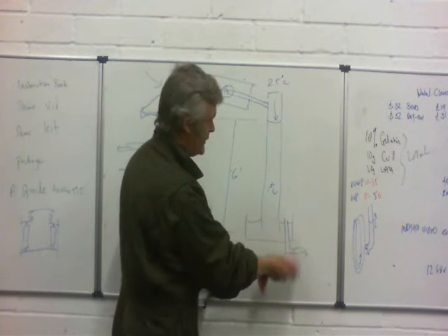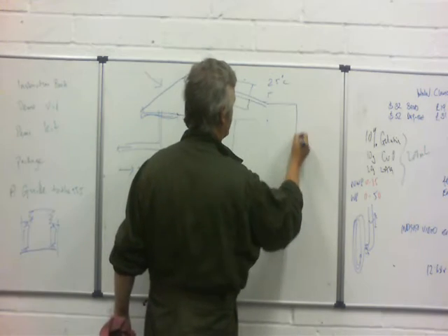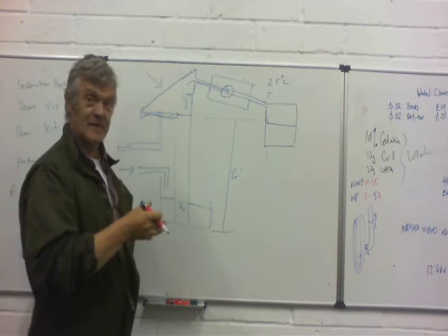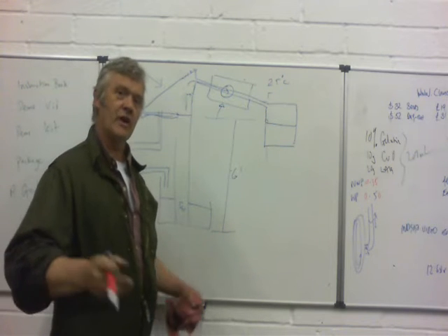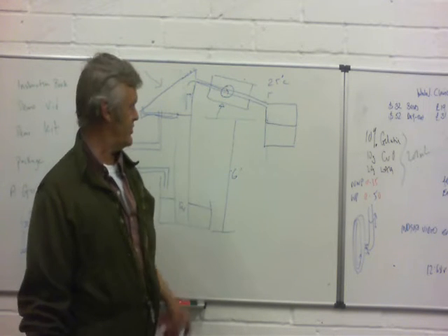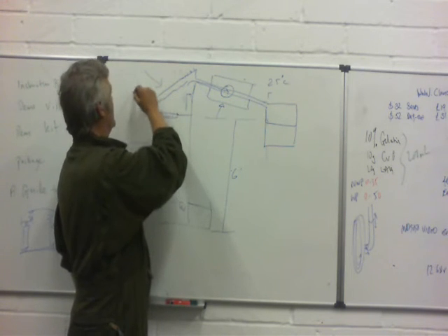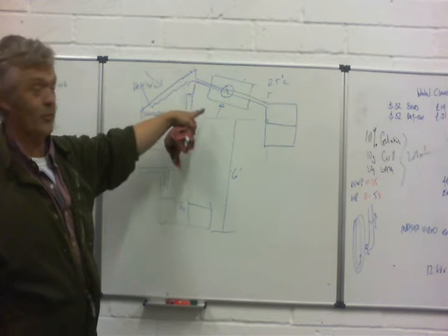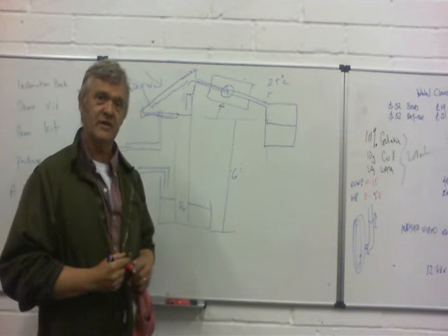When we put a pump in there, there's no need for the fresh water column — we can just have a fresh water receiving tank. Obviously that's more expensive in terms of energy because we're running a pump. There's always a payoff: if we don't want to use much energy, we need the 30-foot-high column; if we want it at about six feet high, we need to input some energy. And if we're inputting energy, then instead of relying on sunlight, we could just put a heater in, heating to around 40 degrees centigrade. The energy cost involved in the pump, the cooling water, and the heating is still going to be a lot less than the energy cost for a standard desalination unit.